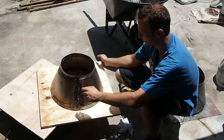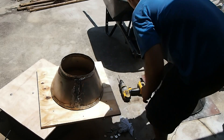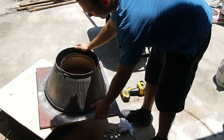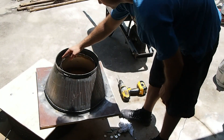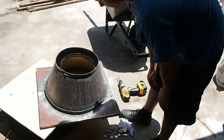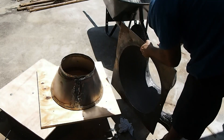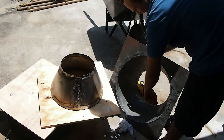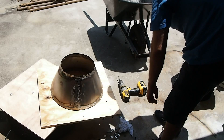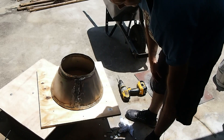So now I'm ready to — what I'm going to do is paint the outside of this with a light coat of oil, and then I'm going to take the outer form and go ahead and bolt this down, then pour the concrete — which I'm about to mix up here in a minute — in there, and then I'll have to let it dry for a day or two. I'm going to go ahead and take a paint brush and lightly paint the inside and outside of both these forms so that the casting doesn't stick to them.